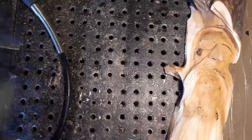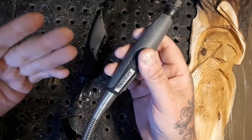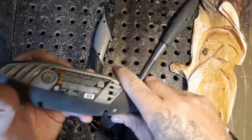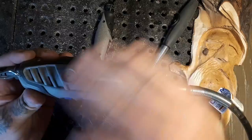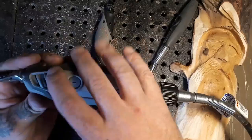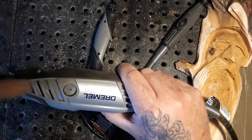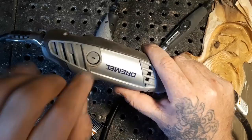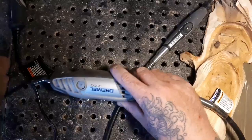Another thing Pete mentioned after my last video when my Dremel died and I changed the brushes - we think it was the brushes that went and I just didn't clean the inner shaft out because the spring was inside. When you change your Dremel brushes, don't wait until it stops - do maintenance on your tools. Blow it out, maybe not with a compressor because that pushes dust further into the engine. Just give it a hand blow with your mouth quickly, and do maintenance every fourth or fifth carving - pull it out, pull this out.